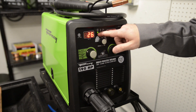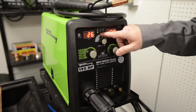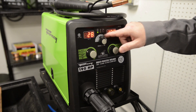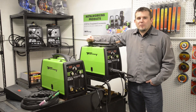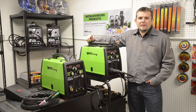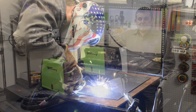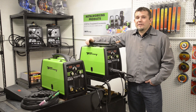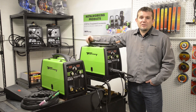On the LED indicator, if it's solid green it's 230 volts; if it's blinking green, it's hooked to 115 volts. There's an over-temperature indicator as well as a fault indicator. When we talk about synergic welding as it applies to MIG welding, what that essentially means is the welding machine is a smart machine — it monitors the arc, optimizes the arc, reduces spatter, and really just produces an overall better quality weld. Synergic welding is great for the first-time user that has trouble finding the sweet spot, as it's very easy to find the sweet spot in synergic mode.